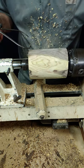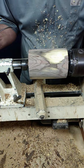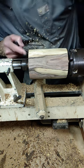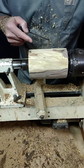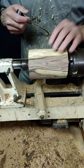Okay, I'm going to take a 16th of an inch off, going down from the 4 and 1/8 that I set these calipers at, to 4. So I'm going to hope that I get this cut out. Let's try it. There's only one way to find out.